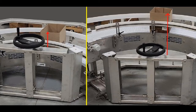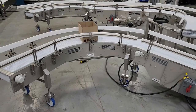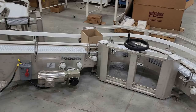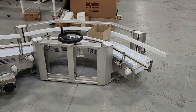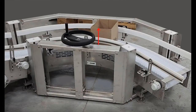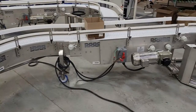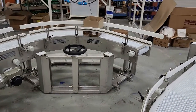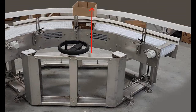Multi-Conveyor recently built a unique conveyor concept to elevate or lower the common top of case flap reference point for empty erected cases, to feed one stationary height case packer. The system required conveyor elevation adjustability for any of three staggered height cases erected on a single lane system, which negated a more common stationary incline or decline conveyor approach.